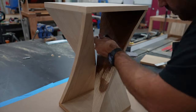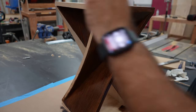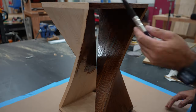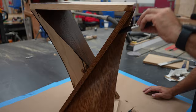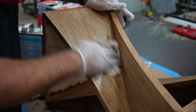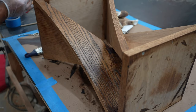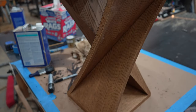For the finish, I want it to be a lot darker and I thought I could get away with using an all-in-one stain and poly. I typically stray away from all-in-one products because you normally get better results using individual products designed for one thing, but I thought I would save some time. I should have gone with my instincts. It turned out so blotchy and streaky — I think because I couldn't get the layer thin enough and the stain pigment stayed in the outer layer of what would be the poly instead of soaking into the wood. So I used xylene to remove the top coat of stain and poly after it had set up. Instead of being faster, it ended up taking an extra hour and a half of work. Once that was done, I thought I would add outlines on the edges with permanent black marker. I actually like the look that gives it.